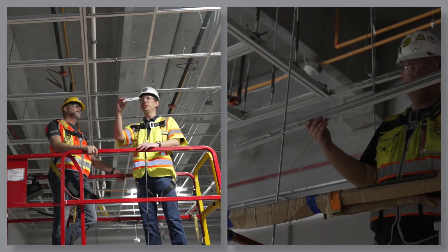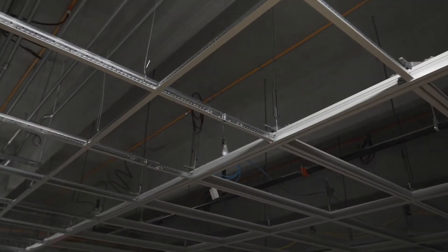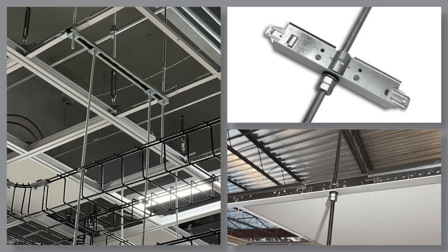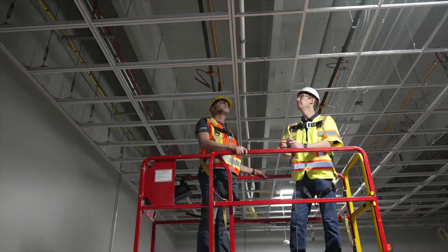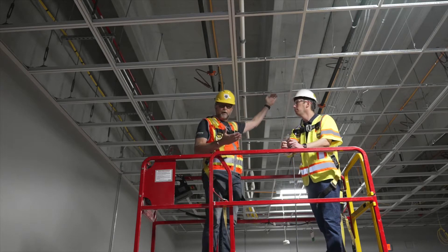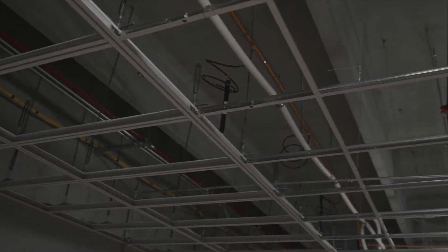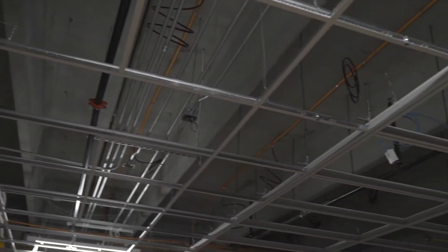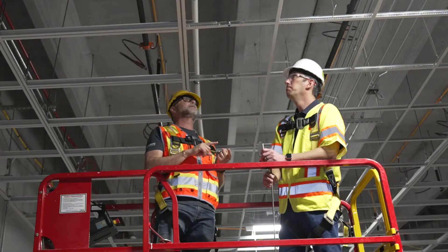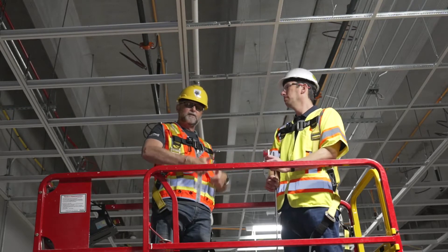This is our CLP clip. As you can see, there's just a 3/8 slot here. That's just going to pop into the Prelude ceiling. What you'll do is take your threaded rod and then just take some nuts as well as an O-ring gasket and tighten that up to seal it. So this Prelude area was obviously an area where they deemed it was not a load-carrying necessary area to warrant the added cost of Dynamax. But there were a few areas where they needed to drop a threaded rod. So that pass-through clip — the CLP clip, we call it the continuous load path clip — does a wonderful job at giving you load-carrying capability in a non-load-bearing system by just tying it directly to the deck.